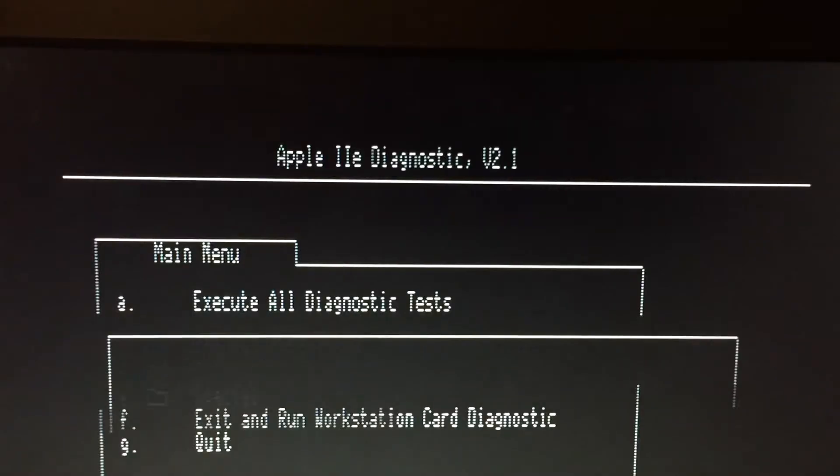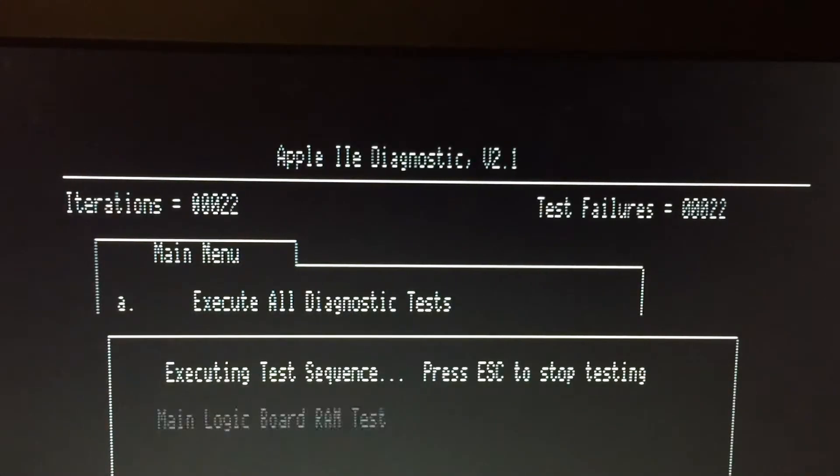Most things run at 13MHz, but I had a couple of glitches among hundreds of tests. What usually fails at 13MHz is diagnostic RAM tests. At 12MHz, I had no usage issues and very rarely RAM test failure. At all lower speeds, everything was fine.